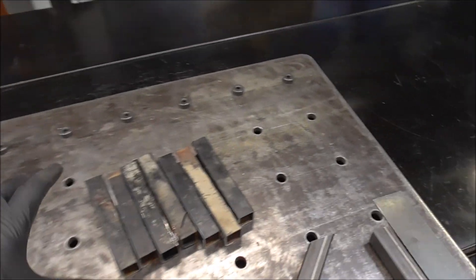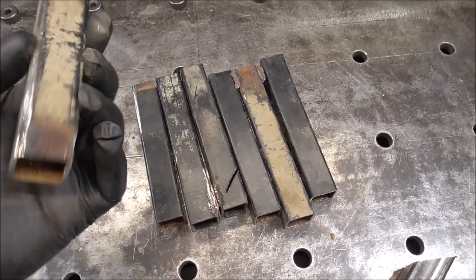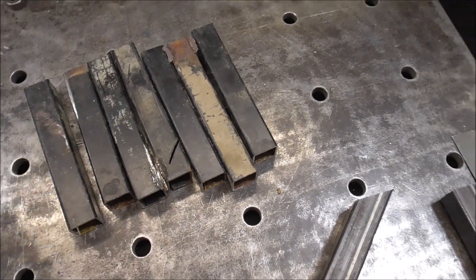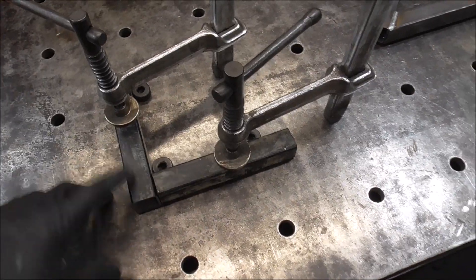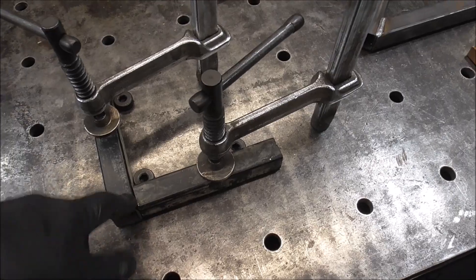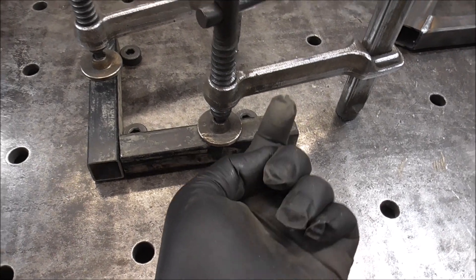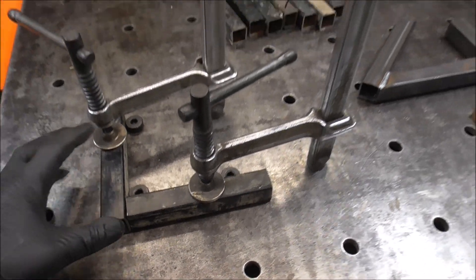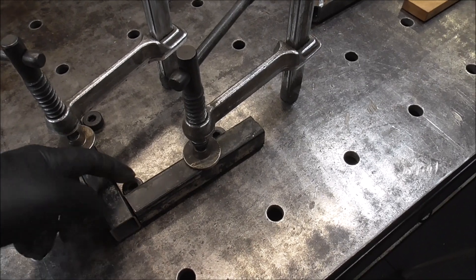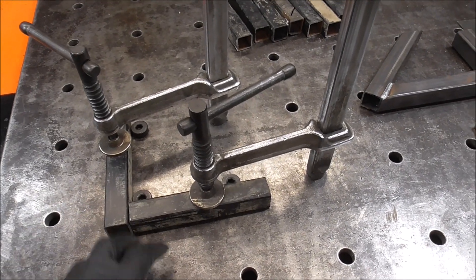These pieces are just coupons cut from scrap metal. They have some paint on them, but that's not what this episode is about. I'm going to show you some scientific stuff on measuring how much things warp under heat. If I weld along this joint, this piece of metal is going to want to lift up. To combat that, hold down your workpiece, and also alternate - don't put all your heat in one spot. Work your way around in a pattern.